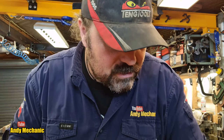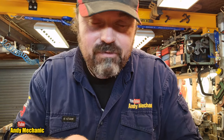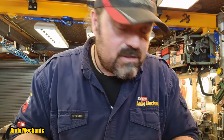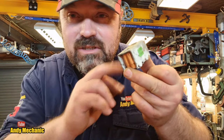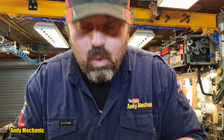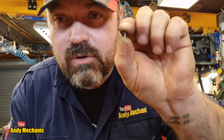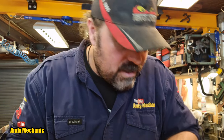What was really interesting was the extent of the corrosion in that solenoid. Looking around online last night I saw comments from people wondering why their replacement relays only lasted a short time — quite clearly that relay is not fully sealed against the elements. If you're using the bike in the sea or a harsh farm environment, you'll get water ingress causing corrosion. We saw corrosion all the way through the relay — and even right in the heart of it. The primary failure was the return spring on the faulty armature — it had completely corroded away. If that's happened, you'll need to replace the unit.